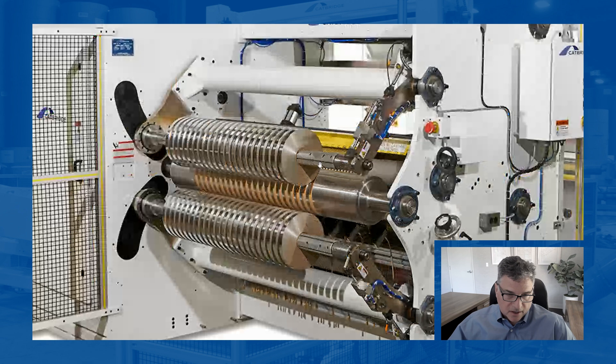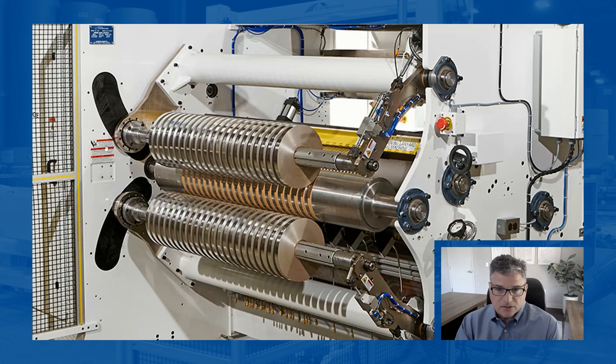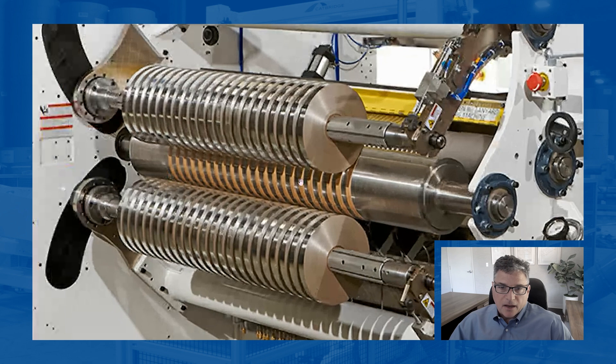You simply slide the cores on and then inflate it. This one happens to be under-guard inflation automatic, but it does a nice job for thin cores and it really inflates concentrically so they don't star out. They actually open up very nice and even. For this particular application, the material doesn't have a lot of caliper, there's not a big buildup ratio, and we're making narrow-ish cuts like in the one-inch range here, and it's doing a really nice job with these leaf shafts.